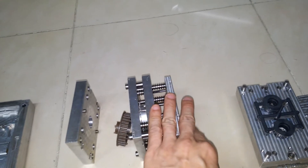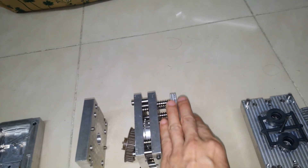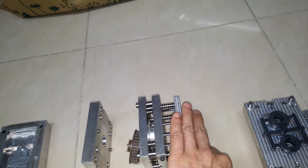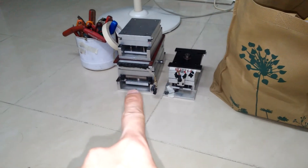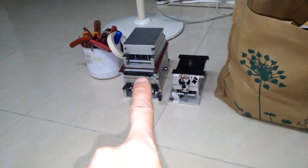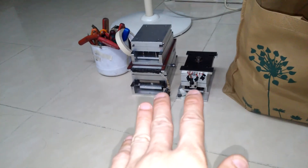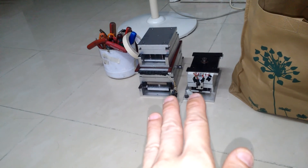The core comes with this plate and it will eject first. After ejection, the ejector plate pushes this part out. Of course this is not the complete mold — you can refer to my previous video. There is a rectangular box with common parts of the mold I prepared — around three types of this block, commonly used for my toolings. These are now assembled in three toolings I just made that are not yet tested — no test parts have come out yet.